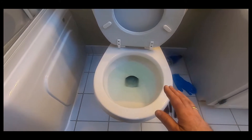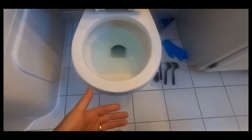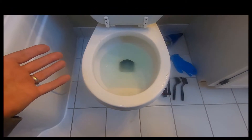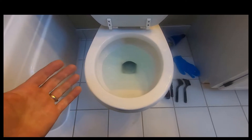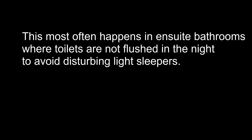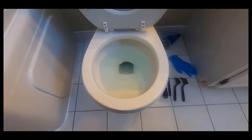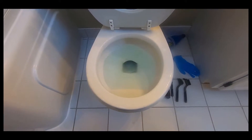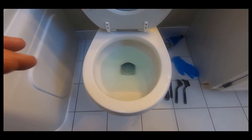The symptom is this toilet used to flush well and now it does go down, but it just doesn't go down with any force and it clogs super easily. Part of the problem is that if you have hard water you can have mineral buildup from the water, but this is where it gets kind of gross. The product that's in urine — whatever — it's not just a liquid; there are solids in urine and minerals and so on.